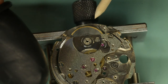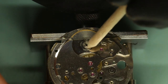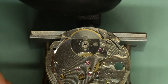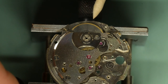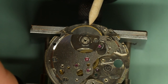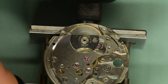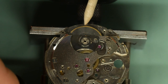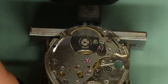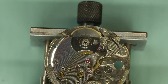With the bridge on, I can spin the barrel just to make sure the gears are all still working. If I put my pegwood in and try to move the barrel from side to side, I'm not getting any play — there is some lateral play, though. Actually, maybe there's a bit more than I'd like. It's very difficult to tell, but it does feel like there's a bit more movement than I'd like. I could be wrong. I'll stay positive and crack on, keep putting the parts on.